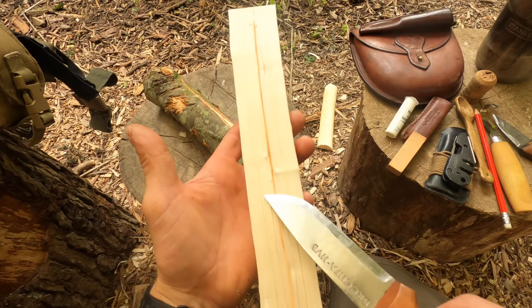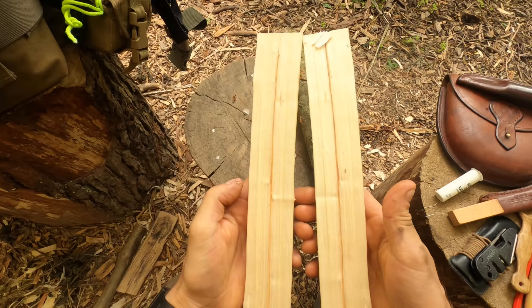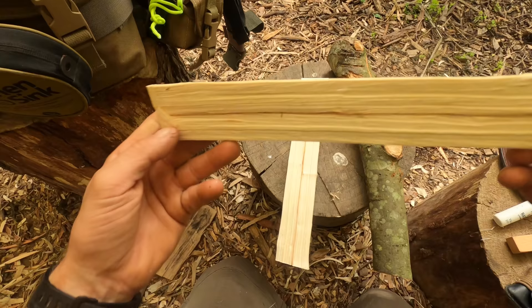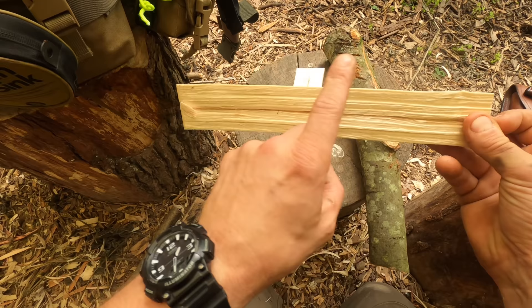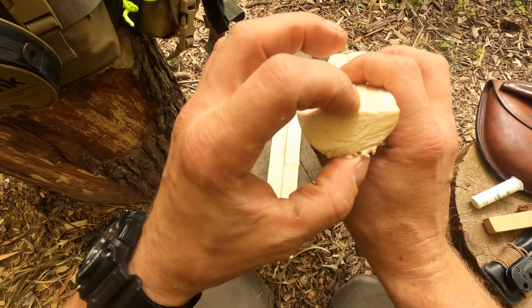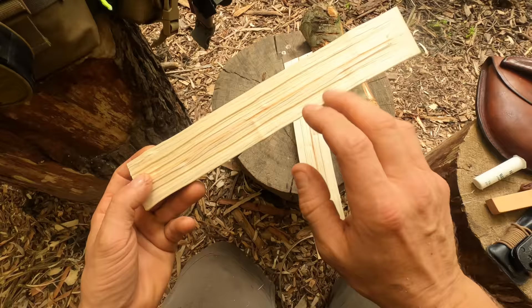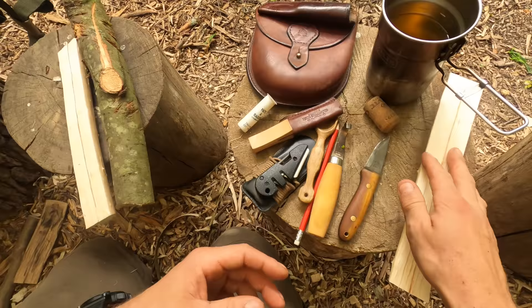This brown colour running down through the inside here is the pith, and that's what we need to remove. Looking at both of these, I'm looking for curvature this way as well as curvature this way. There is a very gentle curvature going that way as well as a bit of curvature going this way. I'm measuring the distance here and I'm measuring distance here. You need to be able to scoop out and make enough bowl to actually do the job it's intended to do. We'll put that one to one side — we've chosen to go with this one.